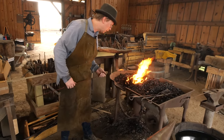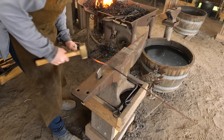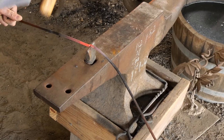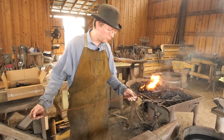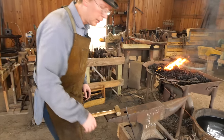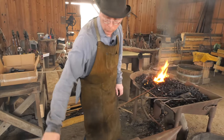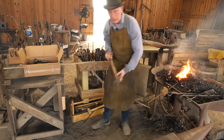I think we are probably good and hot here. This is long and kind of heavy so it's going to get bendy on me. That's okay — bring it here, get it lined up with my cut, just a couple hits and we're through. Ideally I would not have chopped all the way through; I would have stopped before I did, but sometimes you hit it a little harder than you mean to. I want to remember that this end is the hot end, so I'll come around to the far side, pick this up, back into the fire, put away my brass hammer, grab my other hammer, and we'll get to working on this.